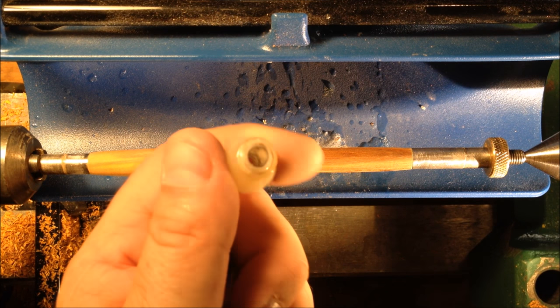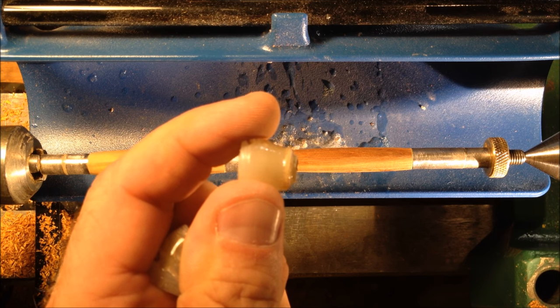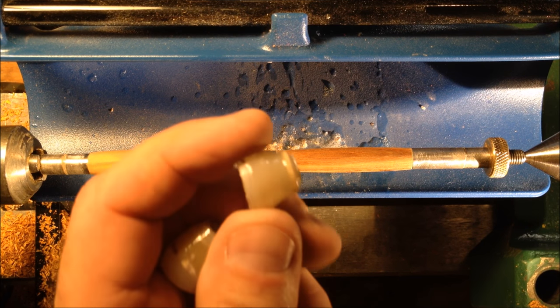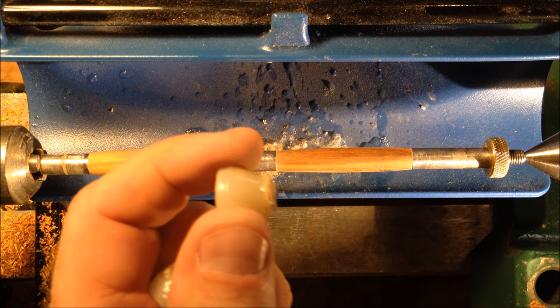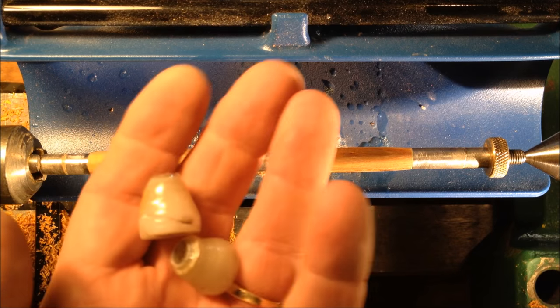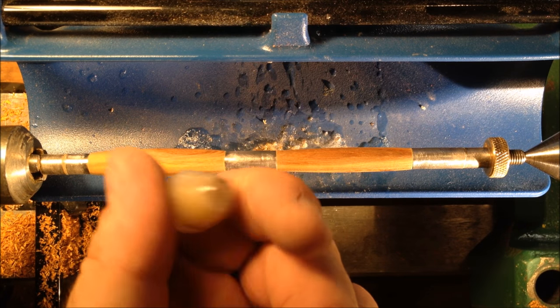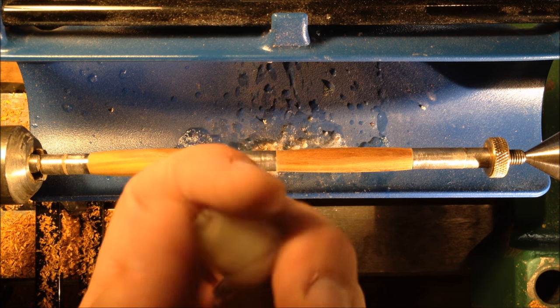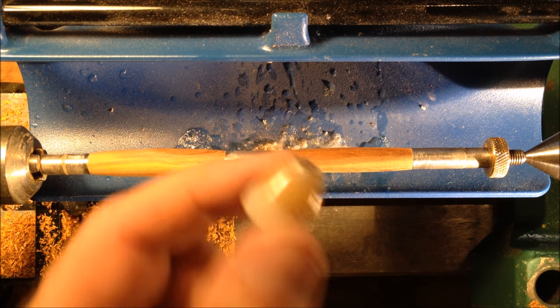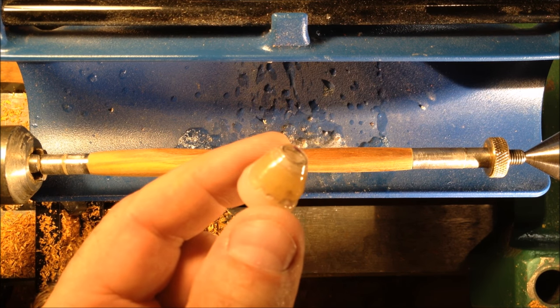You can also make these bushings out of UHMW or ultra high molecular weight plastic. I purchased a 3/4 inch rod of HDPE off of Amazon.com and it was very inexpensive, had it shipped to my house. You could also melt milk jugs, that's HDPE, make a block or a blank and turn your own. I've seen these for sale. They cost about $6.95 a set.